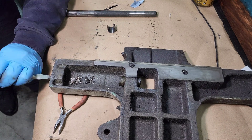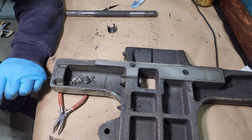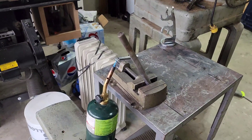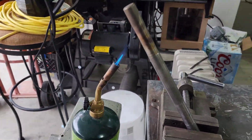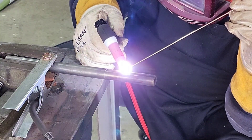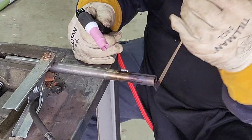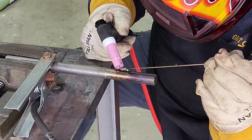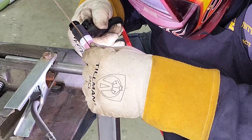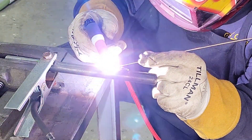The whole thought process here is I'm going to remanufacture the bushing and I'm going to do a silicon bronze buildup on the shaft. So first order of business is take the shaft - we're preheating it right here. This way if it's all heated at the same time and at the same rate it won't warp. I'm not a welder so take everything I say with a very big grain of salt. I'm a home hobbyist in a two-car garage, and my thought is if I heat everything up at the same rate and cool it at the same rate I shouldn't have warpage.